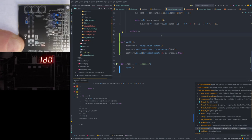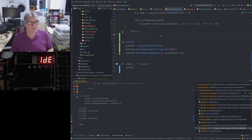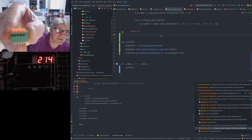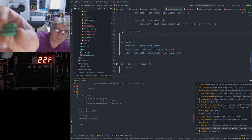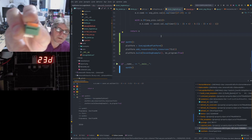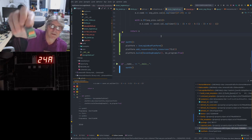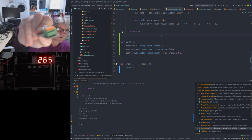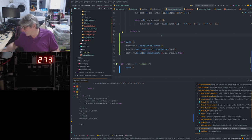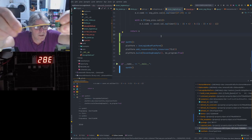There we go. That's the motor tile. I'm still in two minds about the connectors on here as well. But that reminds me. So the connectors I have on here are normal through-hole screw connectors for the motors. One of the things I'm looking at is these. I ordered a bunch of these. These are from an Ali supplier. They're a 0.1 pitch and they've got a good spacing for things like protos. Got it on an old PMOD proto there. And there's no screws, you just press the button or you just push the wire in. Thus, and then it's locked in.